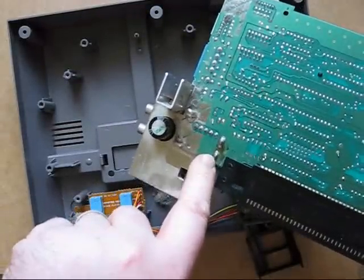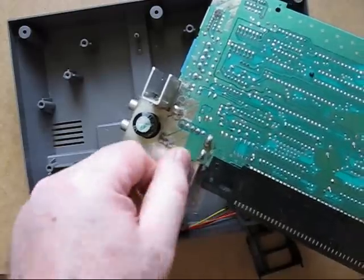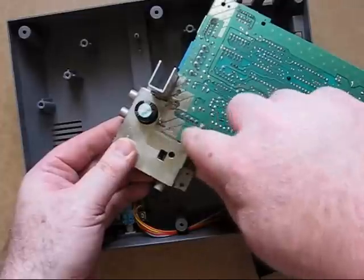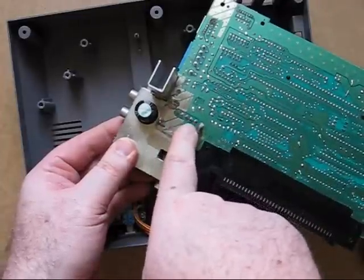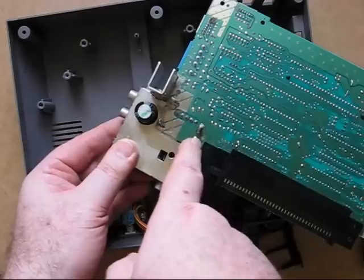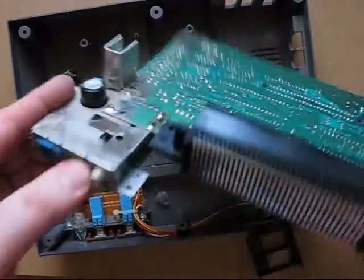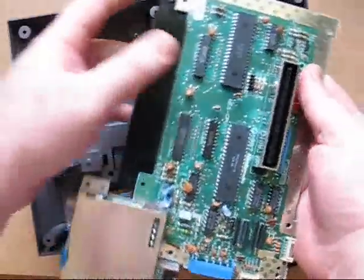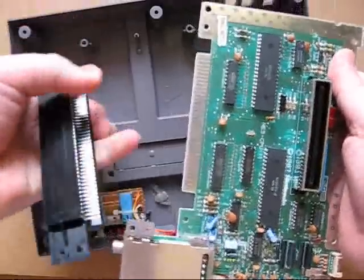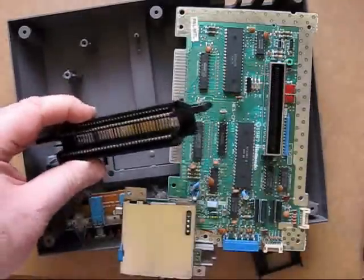The part of the board around here is quite solid and these sections are quite hard to de-solder, but you can use a drill bit to literally cut down and cut these parts out. All this section here, apart from these five pins and their connections, are groundings anyway. So you can cut along here and cut these particular parts out. The cartridge port itself just pops out with a little bit of heat, as it's in fairly solidly.